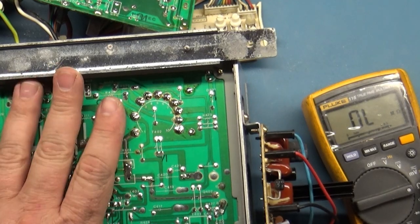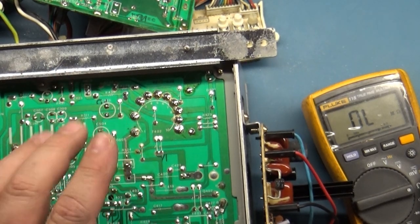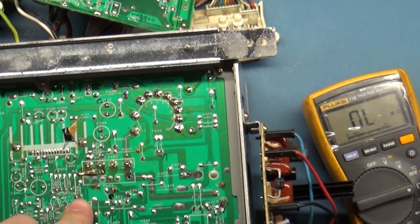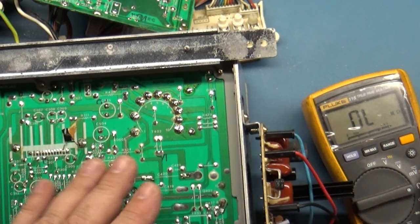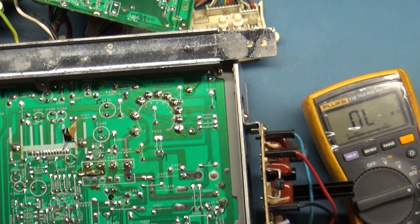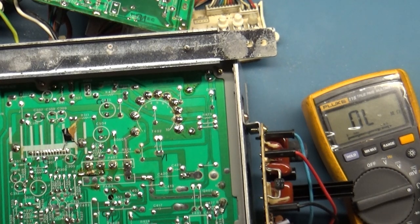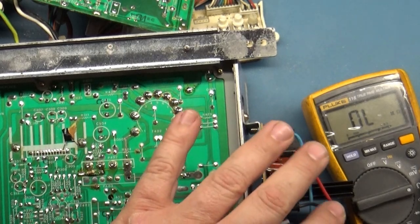All right, so I pulled the chassis out of my Multi Mortal Kombat. This is actually, I think, a 2515D. It's not a 2515C because it has the pincushion board on the side to make a round image versus a square image. The 2515C is the one we're working on, without the pincushion board. This is a different variant.